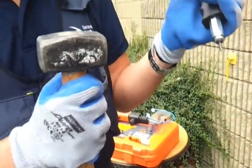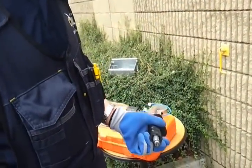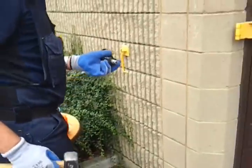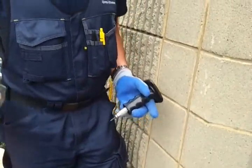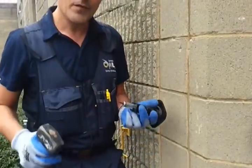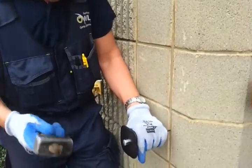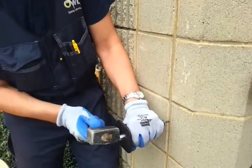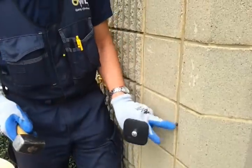And that tool will protect your hand and will also give you extreme strength when you try to put the nail onto the wall. So it has also the advantage, unlike the nail guns which can be too powerful, and if you go into a soft material, the nail can go right through the box, right through everything, whereas with this you have far more control of your power. So I'll just show you, for example, here, if you have mortar, you just put the nail against and then you go, that's it, the nail is in.